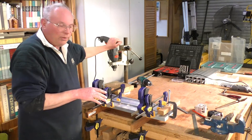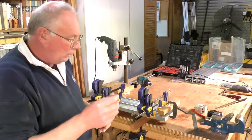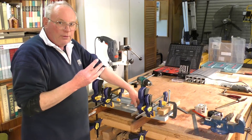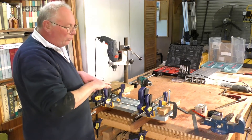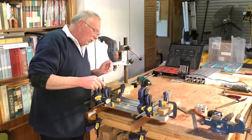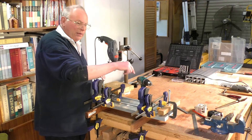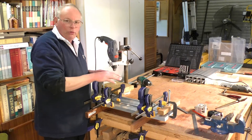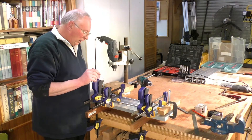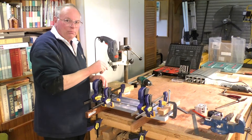When I've done that, I can tap a thread in for these screws and attach that top rail with the four screws. Then I've got it solidly mounted so I can drill all the rest. It's going to be difficult to mark every hole, so I'd rather secure it with four first, check it all — because it's not too late to alter things — and then secure it and mark it with a drill. That's what we're going to do next.